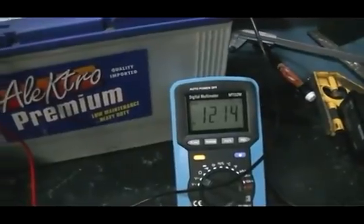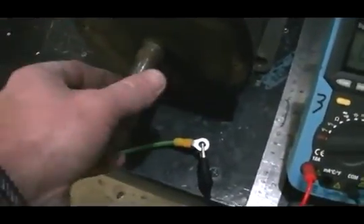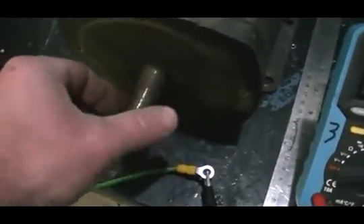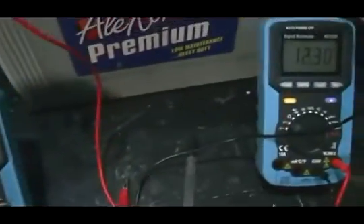So 12.14 volts at 3.96 amps - I'm just going to write that down. It gives us a benchmark: 12.14 volts, 3.96 amps. The first step is we're going to rip the motor down, free up all the bearings, and remove the seals because they're very stiff. I'm not sure whether this is the bearings or the tension on the brushes, or a combination of both. We're going to try and address both and see what we can get our amp draw down to.